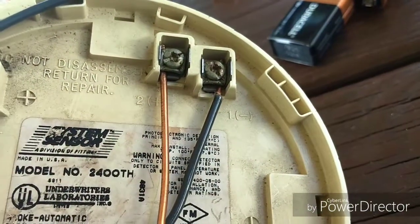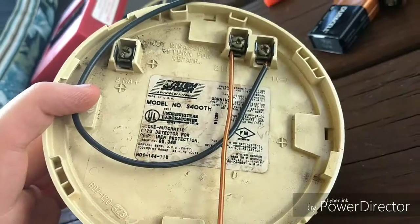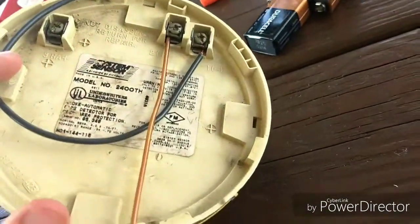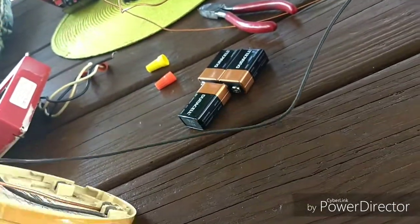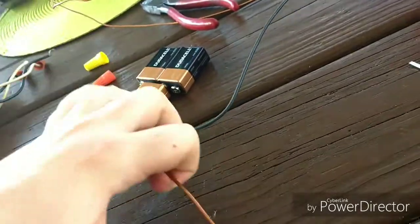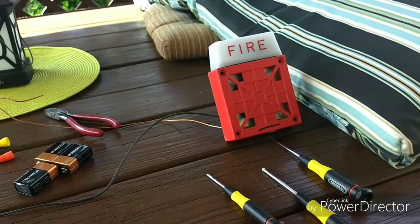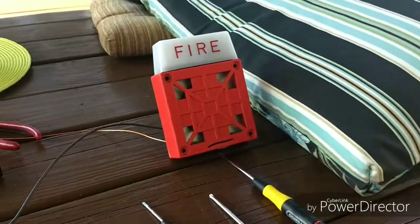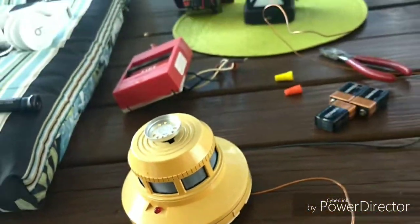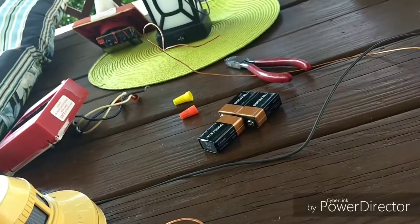If you wire it, you're going to want to use the first two terminals. Any extra terminals would either mean it's four-wire or just there for a resistor. It is very simple — you just wire the two wires into the alarm. Make sure you do the polarity correctly because it will not sound if you try to activate it incorrectly, and it could potentially damage the detector. I had already tested this before — the 7000 2T will sound a little lower-pitched and the strobe will not flash as much when wired with the smoke compared to by itself.